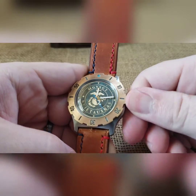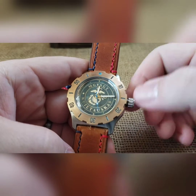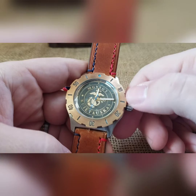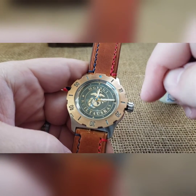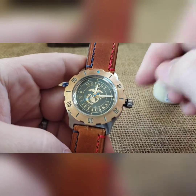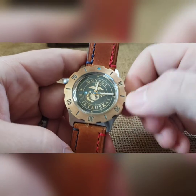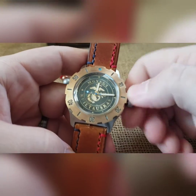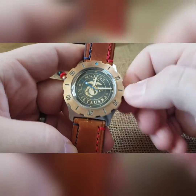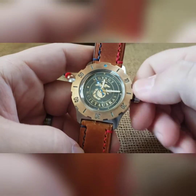Automatic mechanicals — you can wind it, wear it, or put it in a watch winder. If it is dead or you haven't worn it, you want to pre-wind it a little bit. Don't just set your time and put it on and hope for the best — pre-wind it. Back the crown off the threads until you hear and feel it clicking. At that point you can wind — a wind is a turn away from you; turning it back doesn't do anything. If you do this for four or five seconds before you put it on you will keep time throughout the day.